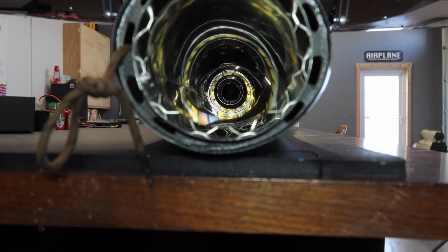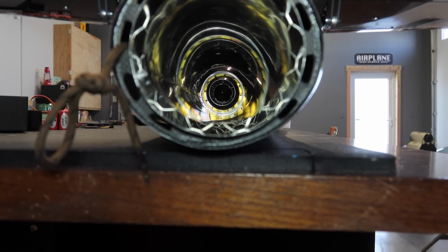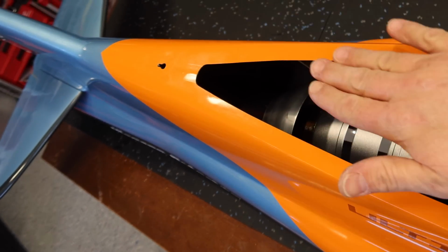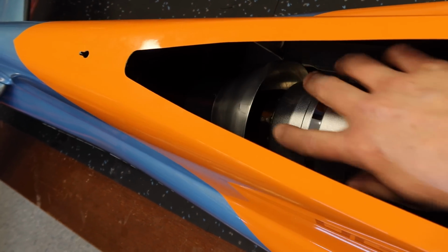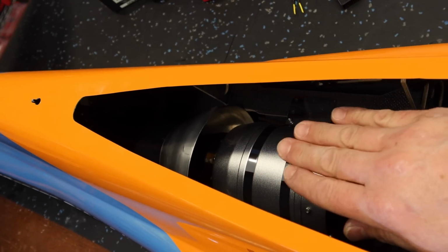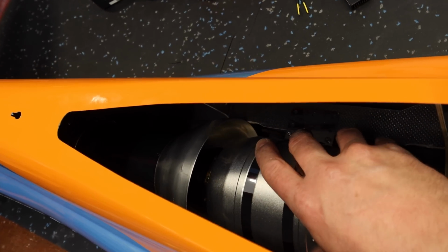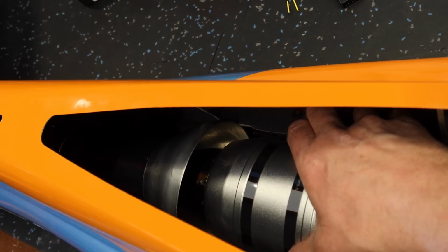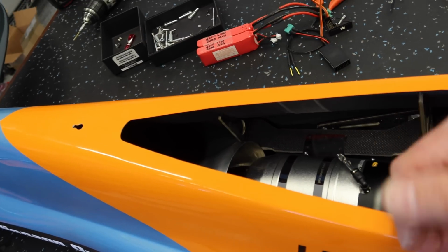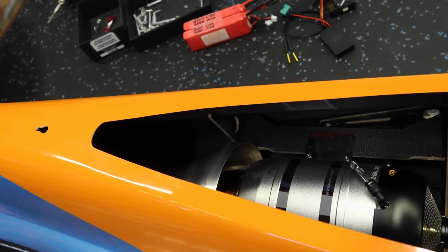And so that's kind of the up and down that we need to do. So we'll just start adding spacers underneath the bell mouth until we are perfectly satisfied with our up and down position. So the up and down position in this case, we are adjusting with the bell mouth and the final screw in position. The side to side is going to be adjusted with the turbine, because we've got some wiggle room here, side to side, so we'll be adjusting that. And of course the spacing in and out of that bell mouth with the turbine as well.